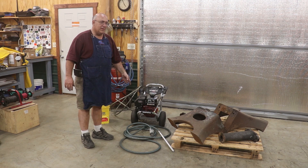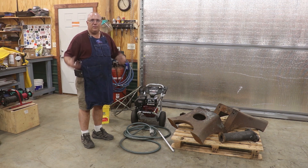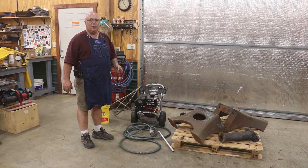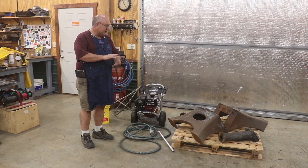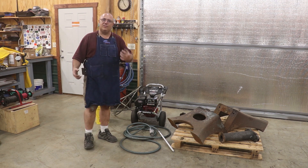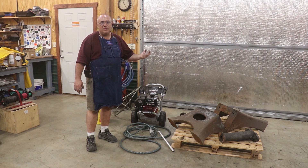This setup here is about 100 bucks. Now I will tell you that as far as speed and the sandblasting job you do with this, it's not as fast and not as aggressive as a commercial sandblasting setup. But for my application, I think it's actually going to be a little bit better — mainly because it's not quite as aggressive. I tend to want to be a little bit more gentle on my parts because a lot of times, particularly with cast iron, there will be filler material in little pockets and voids and inclusions. With traditional sandblasting, you just blast that stuff right out. This setup is a little bit slower and not quite as aggressive, and I have not been blasting out all that filler material, which really saves me more time down the road.